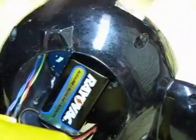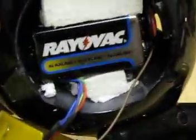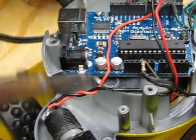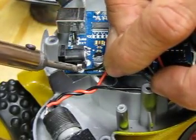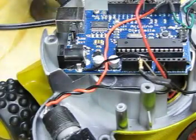You can stick the battery underneath the head in that area — a little piece of Velcro or something works quite well. I found yet another use for EPS foam: to hold batteries in the bottom of Rumble robots run by an Arduino. Now we'll solder our negative lead of the 9-volt battery right over here on the auxiliary battery input. It might take a little bit of heat because it's a big hunk of metal on that jack. We have a ground wire connected.